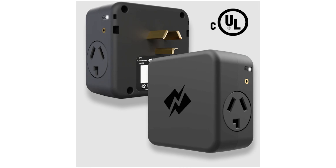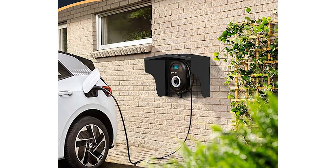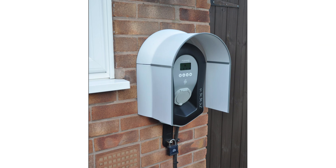There are products that act like switches, allowing you to plug in your Level 2 charger and another appliance like a dryer, with power supplied to only one side at a time. I still think it is best practice, both practically and financially, to have a dedicated 240V outlet for your charger with its own circuit breaker so it does not have to share with another appliance. If you must install your outlet and charger outdoors, extra precautions should be taken to avoid exposing the outlet to the elements. Many chargers have an outdoor rating, but it isn't a bad idea to have some structure to reduce exposure to rain and snow.